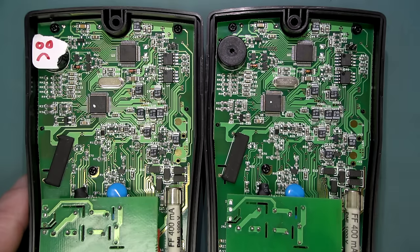There's another star grounding point — very nice. They know what they're doing there. You can see the little isolation slots in there too. These aren't wound inductors — these are RFI beads, actually. Just for some high-frequency rejection to pass emission standards and compliance. You could bridge that over with a short if you wanted to — put in a zero ohm resistor if you didn't care about the EMI requirements. I'm not sure I have a suitable RFI bead, so I might just bridge it with a zero ohm resistor just for now. That should get us up and running.